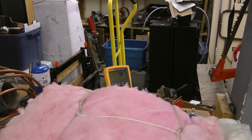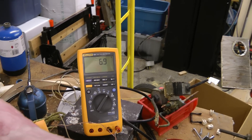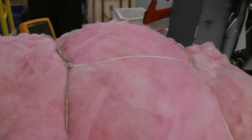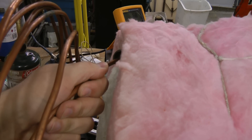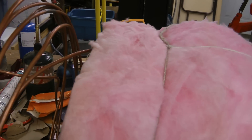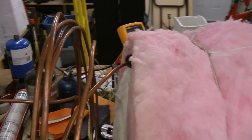It's been running for about 5 minutes and the temperature hasn't dropped that much. It's doing a little bit better now, but I'm thinking the recuperator tube isn't long enough, because the air coming out of this tube seems quite a bit cooler than the tube itself actually is. I think a longer recuperator at the system level with higher efficiency should work better.